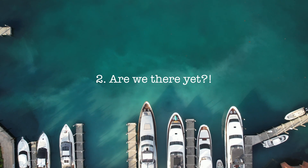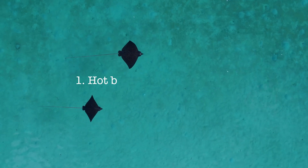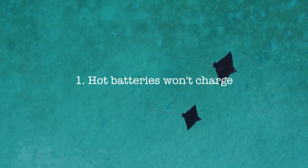Number two: these batteries take forever to charge — around 60 to 90 minutes, which is always longer than we want. And number one confuses a lot of new pilots who ask why their drone battery won't charge. If you just had a flight and your battery is hot and you put it on the charger, it will wait until it cools down before it starts charging. So that 60 to 90 minutes — especially if you flew somewhere already hot — could take even longer as the battery first cools down. These are 10 things you might not know about your drone battery. Check the links in the description for more resources, add your tips in the comments, and I'll see you in the next adventure. Ciao.